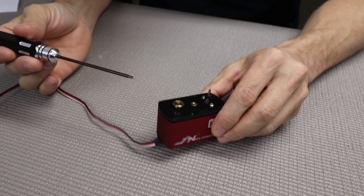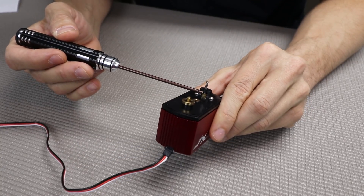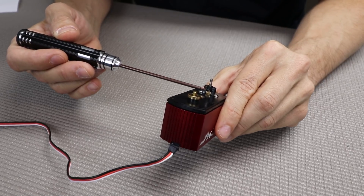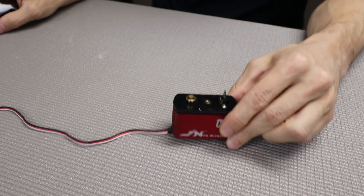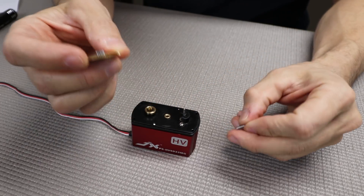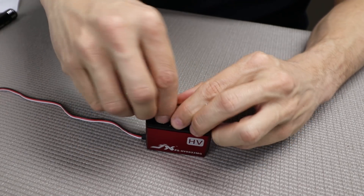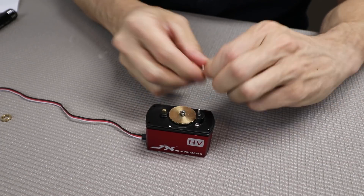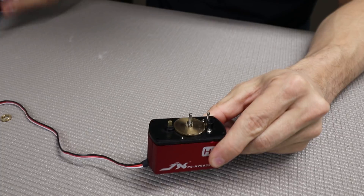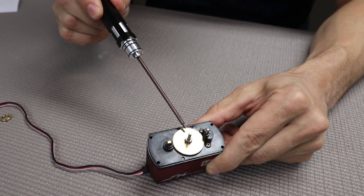On servos, obviously what we're generally looking for is to build more torque, because we've got a real small motor that needs to make a lot of torque. So the way they do that is through torque multiplication. Right here on the output shaft of the motor we have a real small drive gear — a little tooth gear. This is our first drive gear in the sequence. Next up we have a much larger gear that's going to engage with this drive gear. Right away we have this small gear driving this real large gear, which is going to obviously build a lot more torque.